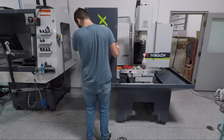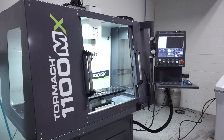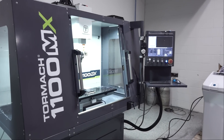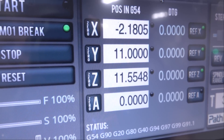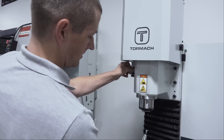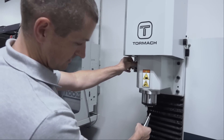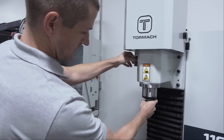Once he had been imparted with these nuggets of institutional knowledge, the thing went right together over the course of a few evenings with no issues. As with the M-Series machines, this has the updated enclosure style and the extended 11-inch Y-travel — the others only go to 9.5, but these go to 11. Being an MX, it also has the 10,000 RPM BT-30 taper spindle with an encoder for rigid tapping and clear path servos on all three axes.